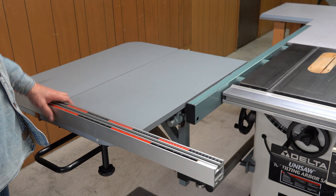And for number 34, just a real simple way to make your tables adjustable and level is just using T-nuts up inside a block of wood and then using flathead bolts or carriage screws, which you see in the distance. Either way works good, and it's fast, it's easy, and it's cheap to do.